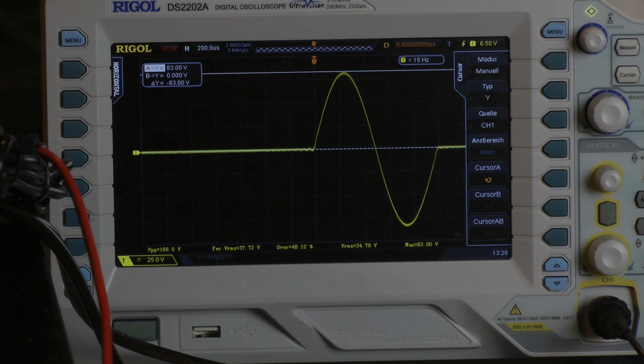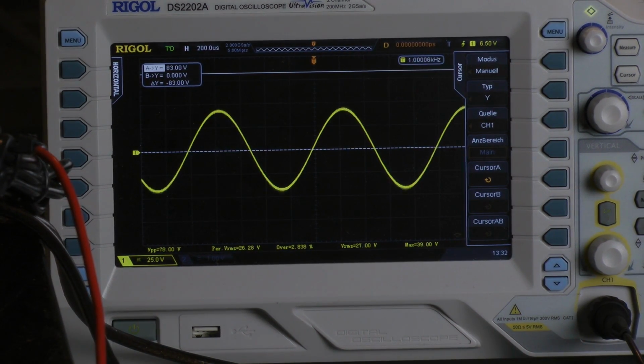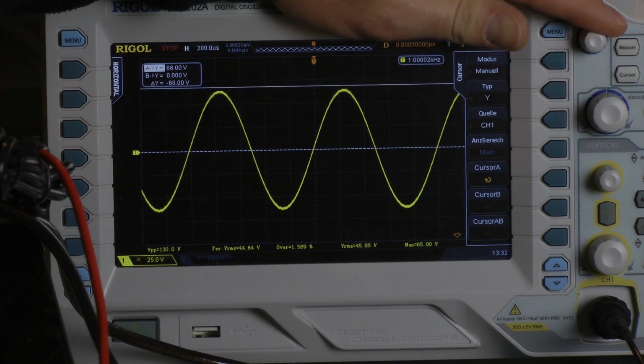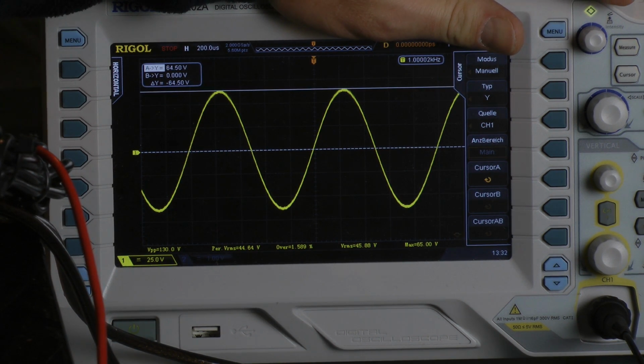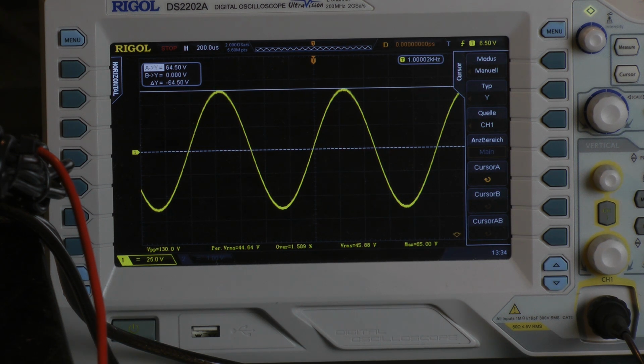Let's go to 2 ohms per channel. There is clipping, I go back, can take a little bit more. That's all. And the scope says 65 volts. I go to this point, let's calculate with 64.5 volts. Mono 4 ohms, that means 2 ohms per channel. The amplifier puts out continuous power, 533.5 watts. That's around 266 watts, 2 ohms per channel, both channels driven.